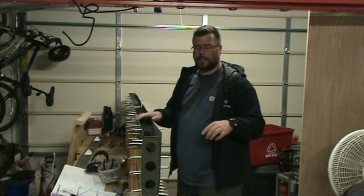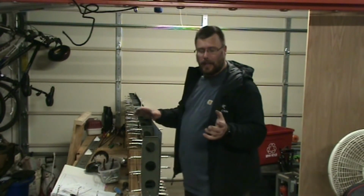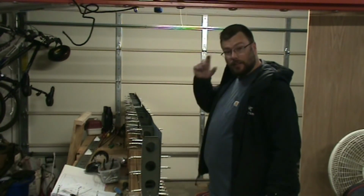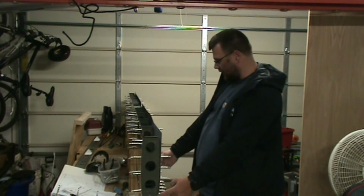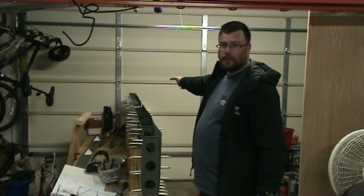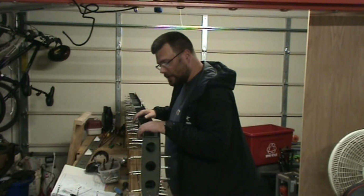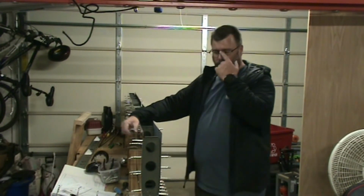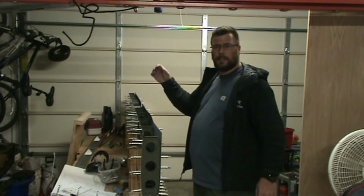Okay, that's going to do it for tonight and this video. And I didn't finish riveting all the front spar web to the skin as I predicted. Pretty close though. I only have about two rib sections here, and then all the 3-4 rivets on the other side, and then I'll be done with step 2 on ATAC 13 and ready to move on to step 3, which will be riveting in the inboard ribs up to the stringer.